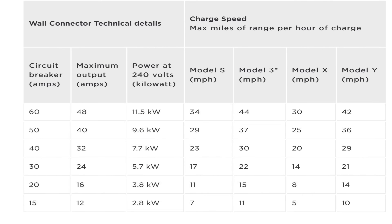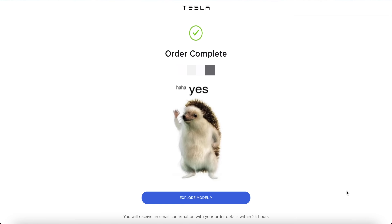I'm not an electrician, so I didn't know about this. Before transitioning to an electric vehicle, I went on Tesla's website and noticed the wall connector — and it said if you have a 60 amp breaker you can expect about 67 kilometers every hour of charge. So I hit the button, ordered the charger, and then got an electrician. The electricians came and said, 'Hey, you cannot have a 60 amp breaker,' because my house has a 100 amp service. It's a big house with air conditioning running on a 40 amp breaker, so our house could not get more than a 20 amp breaker.